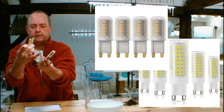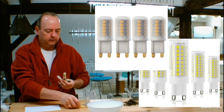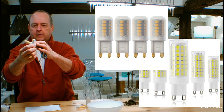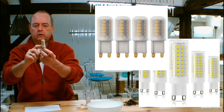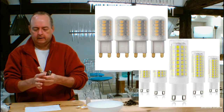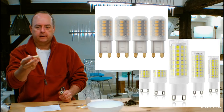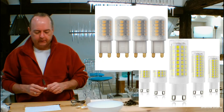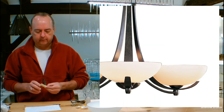This one is a 75-watt equivalent, this one's a 60-watt equivalent. This one has a frosted milky plastic diffuser, this one's clear. If you're hanging this where someone will be looking down on it from a stairway, you might elect to go with one that has a frosted diffuser so you don't get glare. If it's above your head in a kitchen and you're not looking down on it, you can go for one of these larger Cob LEDs that's clear — I use this a lot in my showroom. Buy a dimmable version and put it on a good dimmer that's equipped for LEDs — that's very important.